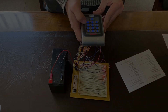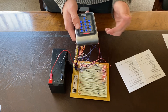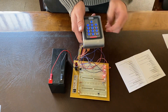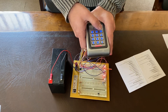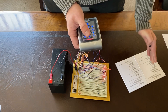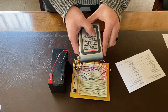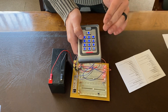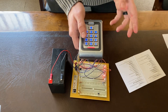This is a video on how to program a PIN and a user number on the device for door one. Door one is indicated here — that LED is normally open. We want to go into programming mode by inputting the master code. Press star, then the master code: six-nine-one-two-three-four-five-six. Now we're in programming mode — that LED indicated it. If it beeps twice, you did something wrong and need to start over.